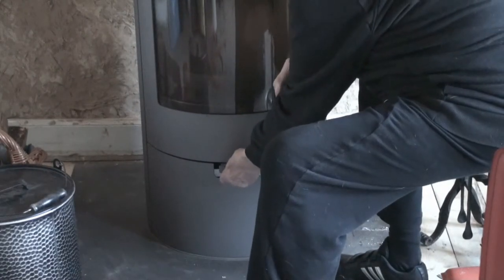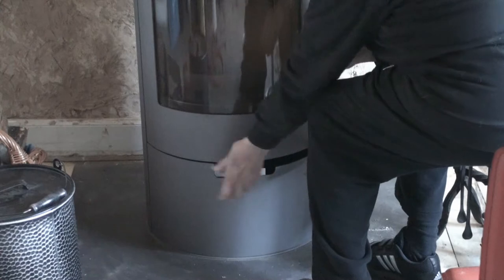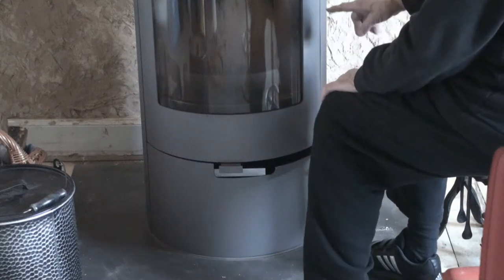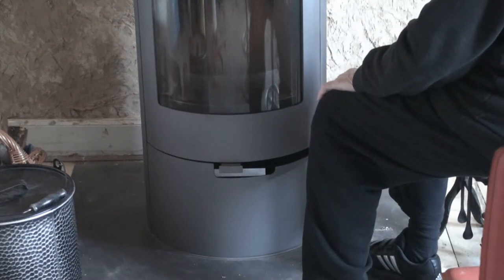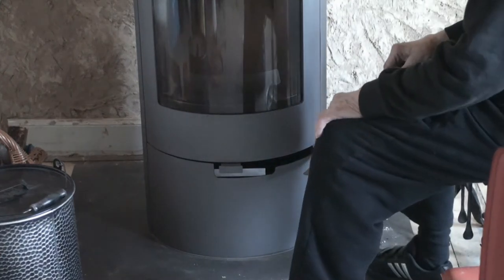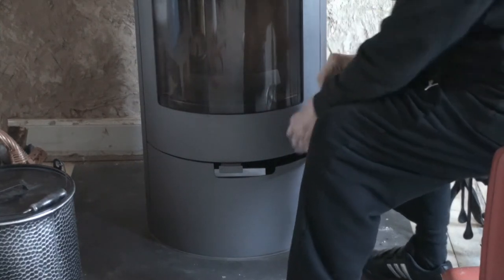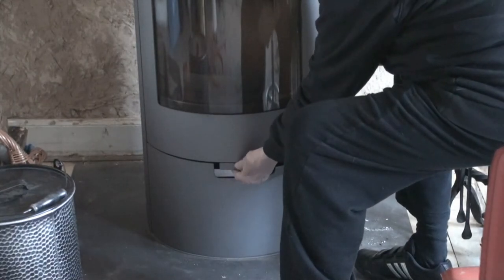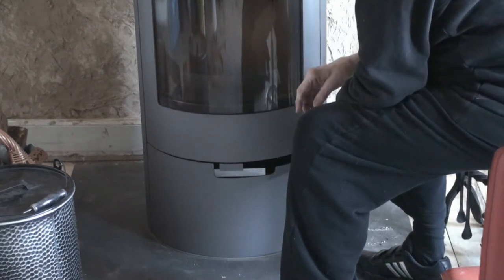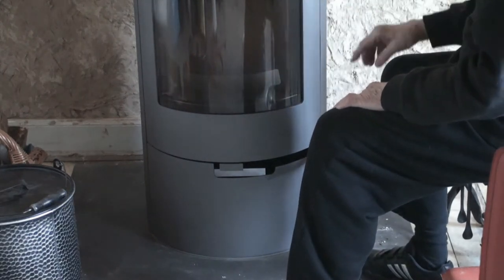There's a damper here — actually this is just like the one downstairs that I showed you. There's a little lever to pull out that regulates the flow of air inside the stove. There's also a damper up on the pipe. We'll leave that open and keep this one open to light, then push it in about three-quarters of the way once the fire is burning. That keeps the glass in front clean by circulating the hot air inside the stove.